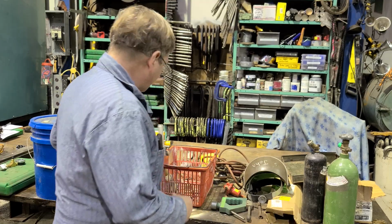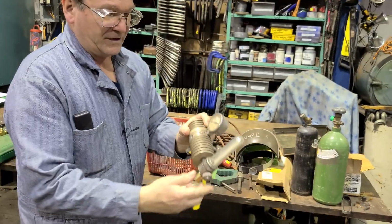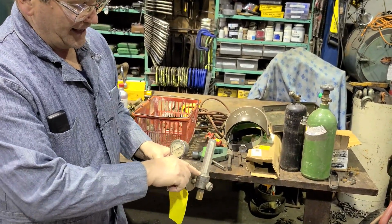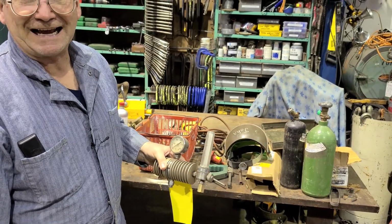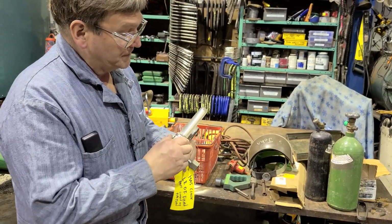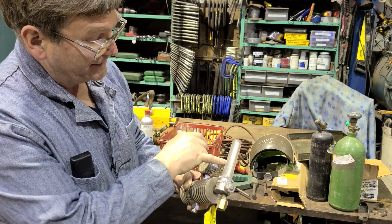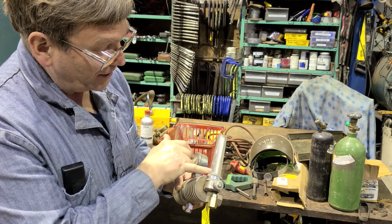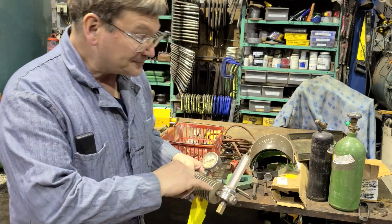I was showing this here with the flow gauge. Flow gauge, there's a little ball in there. So what this does is, you can see how many cubic feet per hour of your gas you figure that you're using, is what this meter is about. And when you do these, you have to look at these and you have to see, like this one says carbon dioxide CFH. And it says read top of flow, and it should say ball before that.